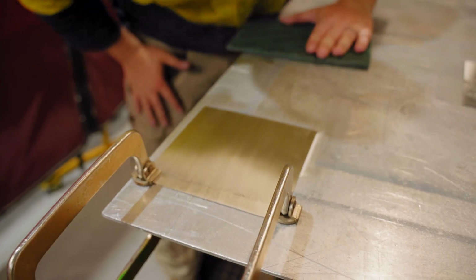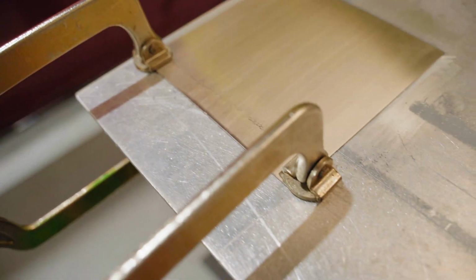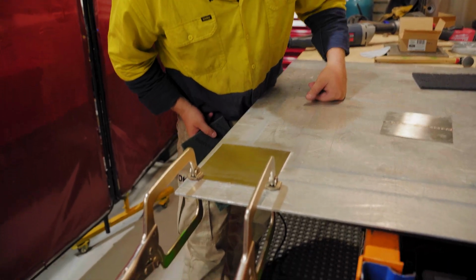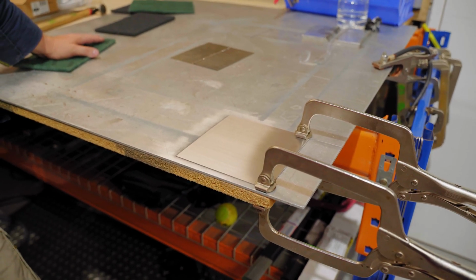As you can see along the sides here, along that top, you can actually see just the powder coming off. That's the actual green powder actually cutting into that stainless, surprisingly. And guys, there you have it. That's how you polish stainless steel. If you hadn't known previously that was welded, you would think that that's just a square plate.